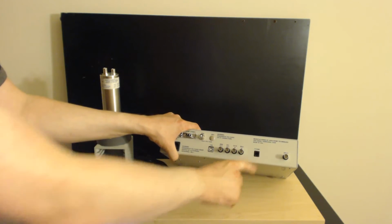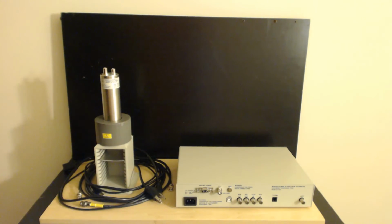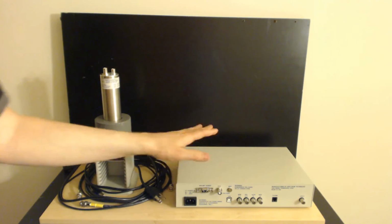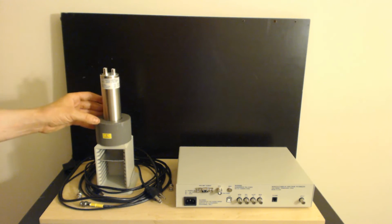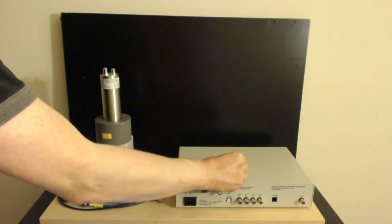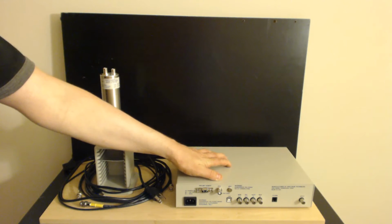And then the temperature compensation cable here connects into a base. If you have a base that connects to this that actually knows temperature, the idea is that you could use this thing to calibrate for temperature on the fly. And that's important because temperature is very important to crystal detectors like this. As temperature changes, the channel in which a particular pulse is put changes as well. But regardless, I don't have that feature on this one, so I have to be somewhat careful about temperature.